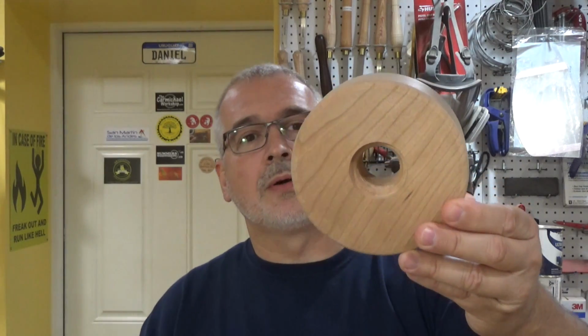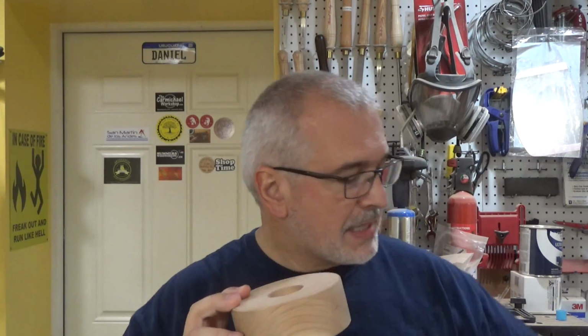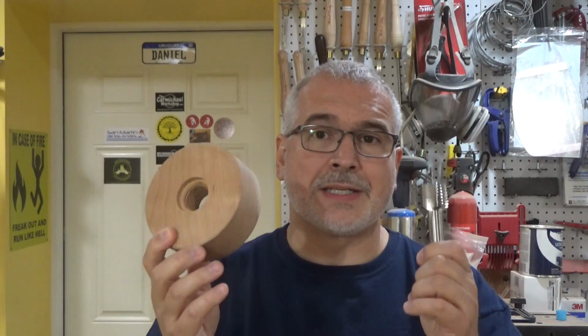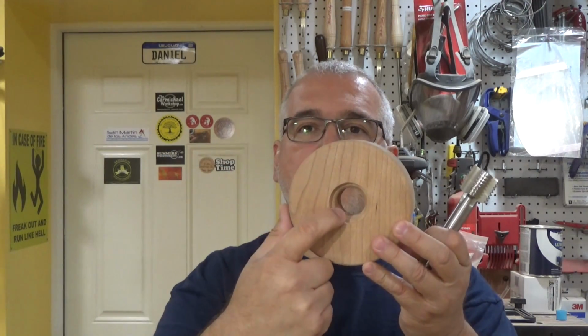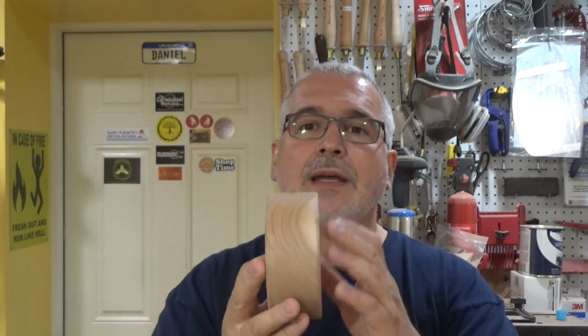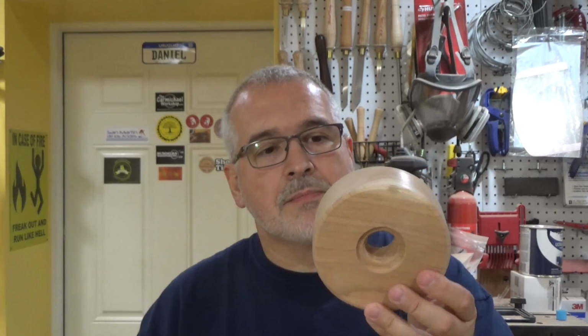In the past video, I did this glue block. It's a threaded glue block that has the particular characteristic that I did it using a hand drill, and then I passed the tap only with the help of a French wrench. Even though that wasn't really precise, after I had the thread, I mounted it in the lathe, I trued up all the surfaces, and I got a glue block that, in my belief, is 99% precise, okay?